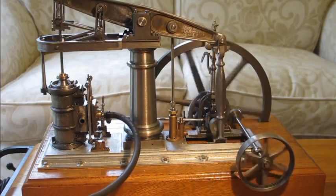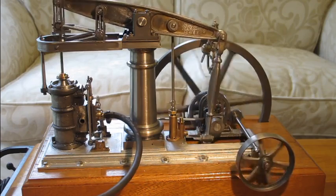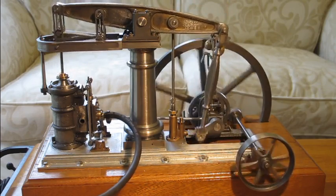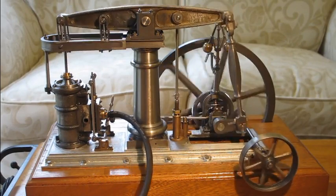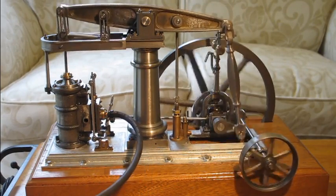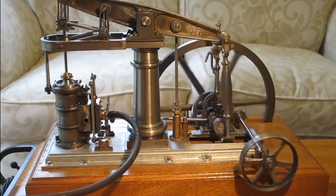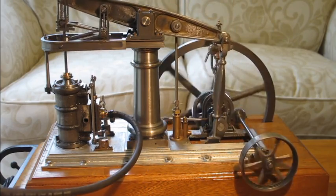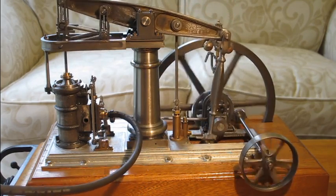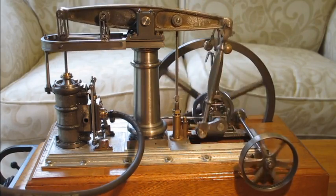Some of the difficulties I had with the design: as it was the very first engine I had ever built, tolerances were something which are not specified on the engine and I found very difficult to understand. So at first everything was made to the dimensions and everything ended up being really tight. However, with a little bit of running in, the thing is now reasonably smooth.